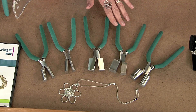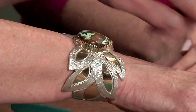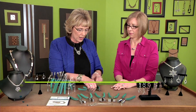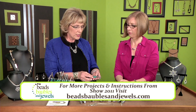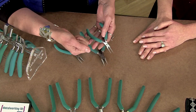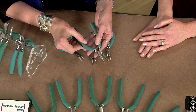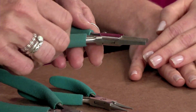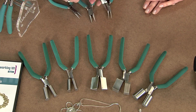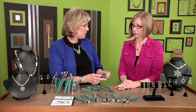You can also use them for shaping bezels, like the bezel on this bracelet here, shaped using some of the larger pliers. You use round edge pliers — whether specialty or standard — to make curves. You use sharper edges, like the one on this flat nose, to make sharp bends. Squares or triangles make sharper bends as well. You always try to choose a jaw that will make the type of bend you want.